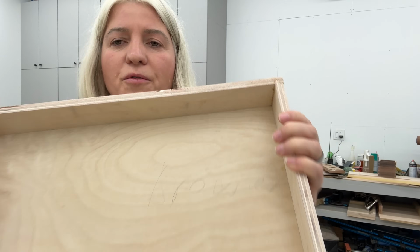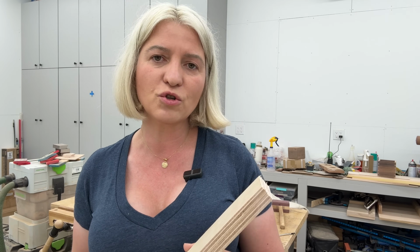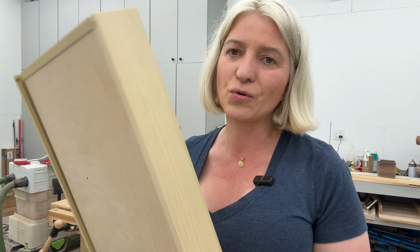This method, it's called quarter, and that is because it's assuming you're using 1/2 inch material, which is usually used for drawers. But if you want to make the same joint with 3/4 inch material, then you will use the setup with a half of the thickness of that. So instead of quarter, as I will show you how to set it up, you will be using 3/8, because 3/8 is a half of 3/4. So you'll be using 3/8, 3/8, 3/8. But for this one that I'm making, we are going to use 1/2 inch material. So we'll use the quarter method.